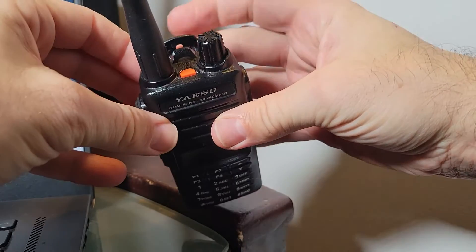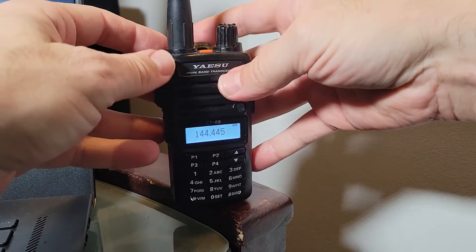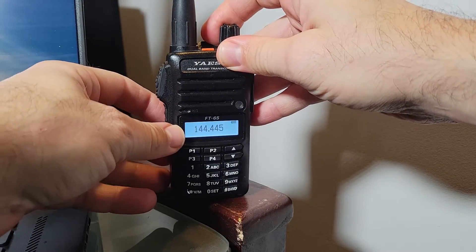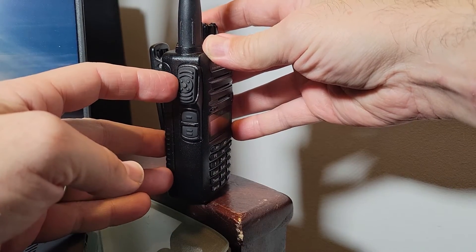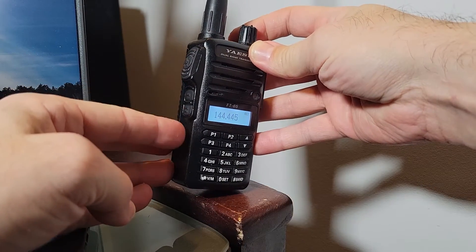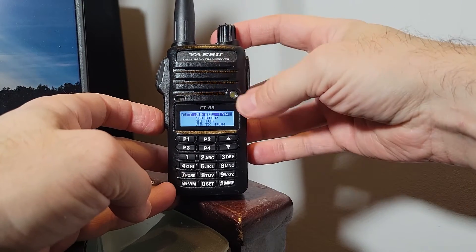At the top, you also see the orange button. That's kind of a tactical feature — you can trigger the screen on and it turns on a little flashlight. If you click that on and off, you will get the screen to light up so you can see what you're doing in the dark. On the business side of the radio, at the very top we have the push-to-talk button. Below that, we have a squelch release. Below that, the function key. Holding down the function key will get you into the menu, and you can scroll through the various settings. Tapping the push-to-talk will drop you back to the frequency screen.